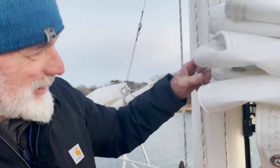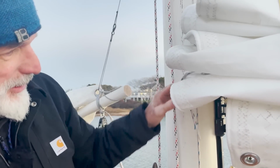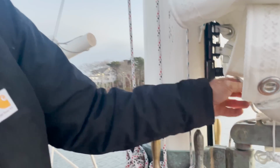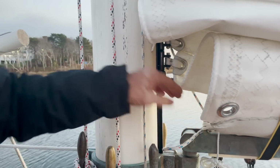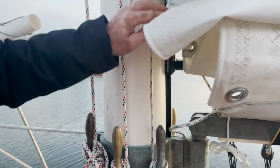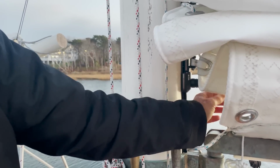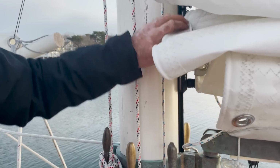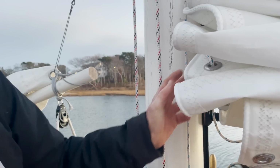Okay, yeah, so this line, your reef tack downhaul line right now, running back through here is giving you the wrong lead. It's pulling the sail. This grommet wants to live fairly close to the track, and it's pulling it aft and away from the track. So it's really loading up that next car just above that when you're reefed.